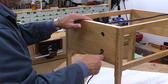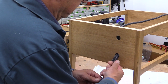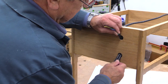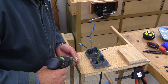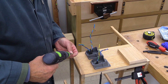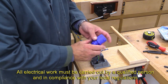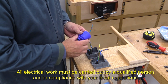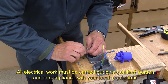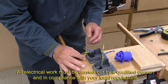All I've got to do now is feed an extra piece down through here because we've got two sockets in parallel. I can see them there. Now I'm able to get these back covers screwed in place - I did actually check that they're in a line so they look nice and tidy. All I've got to do is put the actual socket or plug part into these and then I'm done. Now, let me remind you that if you're going to do any electrical work you have to be competent enough to do it. You have to be authorised to do it depending on the rules and regulations in your country, and if necessary you need to get a professional electrician to check your work after it's done.